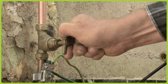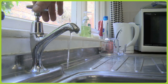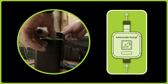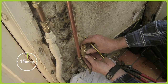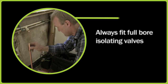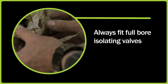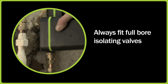After turning off the mains water supply and draining the system, you can prepare the unit ready for fitting. You need to ensure that the unit is mounted with the inlet and outlet vertical, in an area protected from frost and with access provided for servicing. Measure up the pipework ready for cutting. Good plumbing practice is to fit full bore isolating valves into the inlet and outlet pipework of the pump to facilitate service and removal of the pump, so make sure that you leave enough room for these additional fittings.